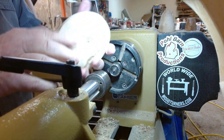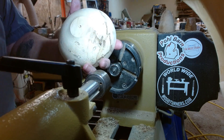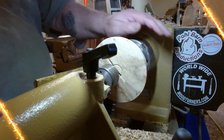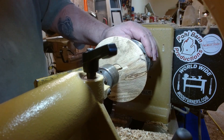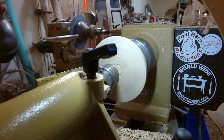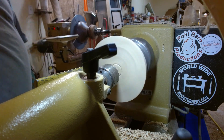I'm going to use my brown paper trick and glue a block under here so that I can chuck it up and get this thing turned. This didn't glue up as true as I had hoped — that or it moved an awful lot on me. I'm not sure. But it's alright. I'll true it back up and we'll hollow it out.